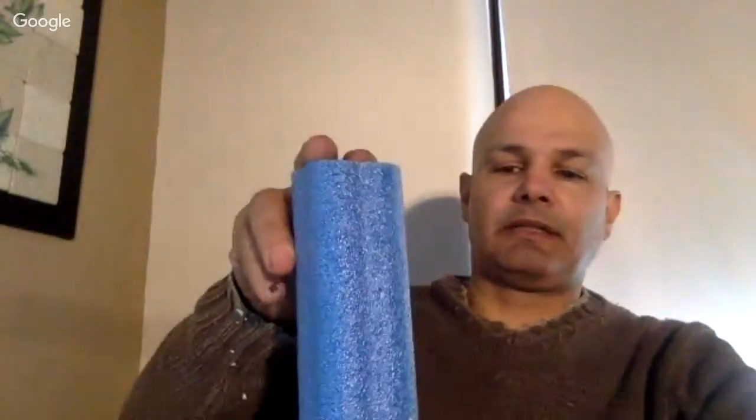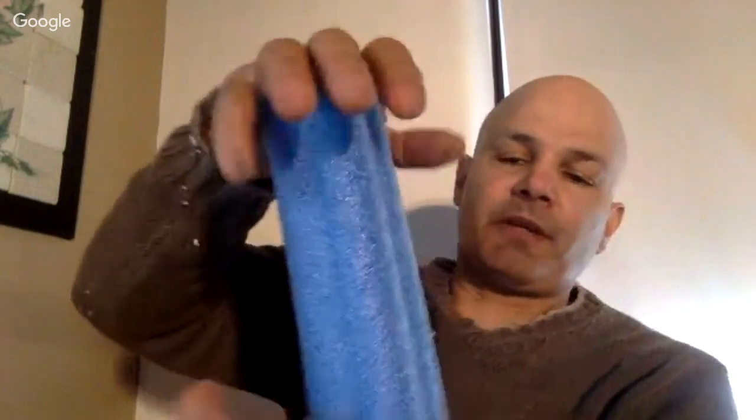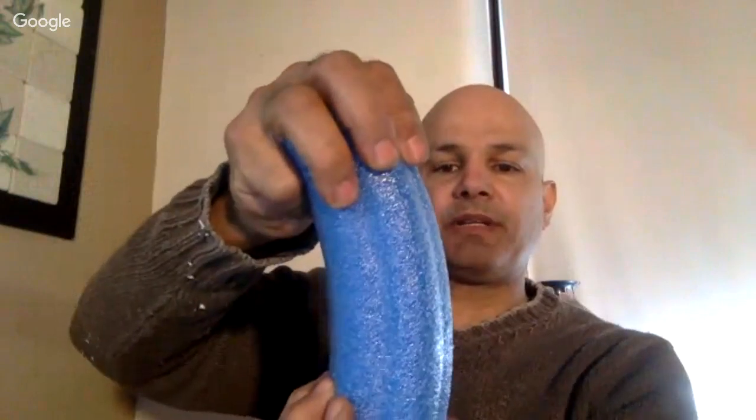There we go. So as I put a load on this, it compresses, right? It's a compressive load. But if it compresses too much, it will bow out. It will buckle out in the middle. That's what's happening. See it? It's displacing, right? And with concrete and the steel buckling, it's going to push it in the outward capacity like a belly. And perhaps I can show you a couple of quick Google searches on that. You also get that happening sometimes where it will blow out in any capacity. You'll see it blow out.